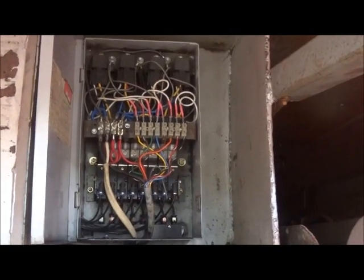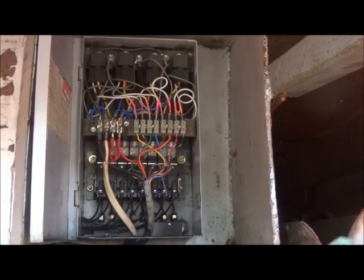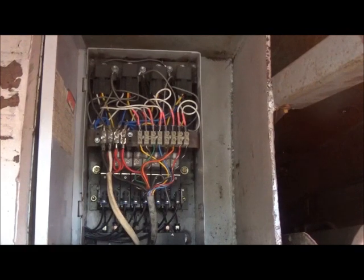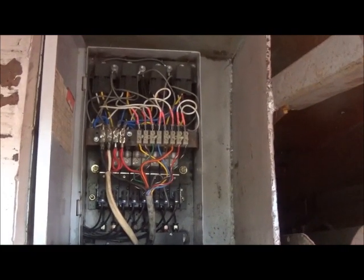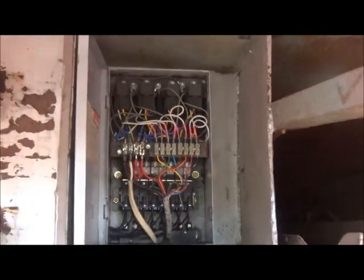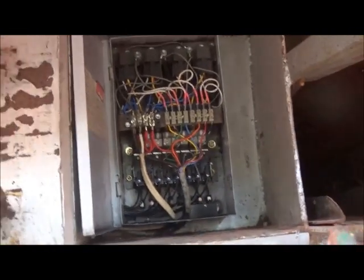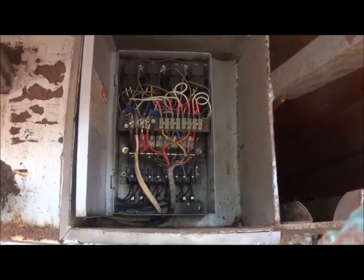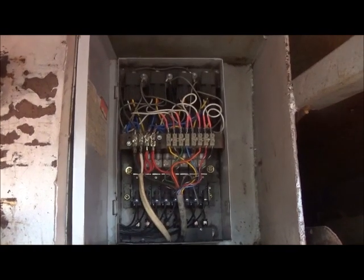On our rotator, I'm going to buy a 15-function remote — I don't know why it's not 16, but it's 15, all momentary buttons. We're probably going to use at least 12 of them. I want to be able to operate both winches, boom up and down, boom in and out, rotate, and slide forward and back, all off the wireless remote. We'll still be able to do it manually, which is always nice. I've had wreckers with solenoid-operated control valves where an electrical problem meant losing all function — with this setup it serves as a backup.